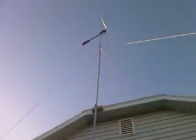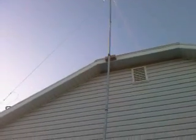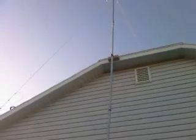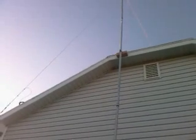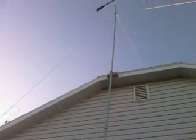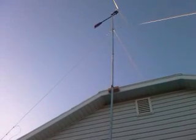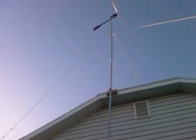This notched 2x4, 8-foot section was instrumental in helping push the tower up, because that pipe isn't quite thick enough to lift the whole thing on its own — at least not with any level of confidence. Up there you can see where I mounted it to the eave, and just over to the left you can see a little eye bolt. That's right into the eave, and that's where we connected a pulley. That pulley connected up to the top section of the tower with a couple of knots so that we could pull it up.